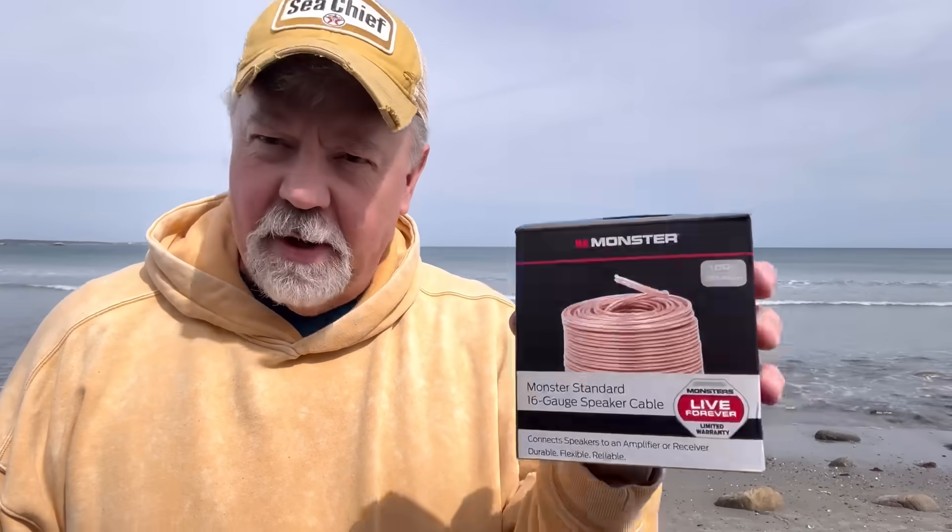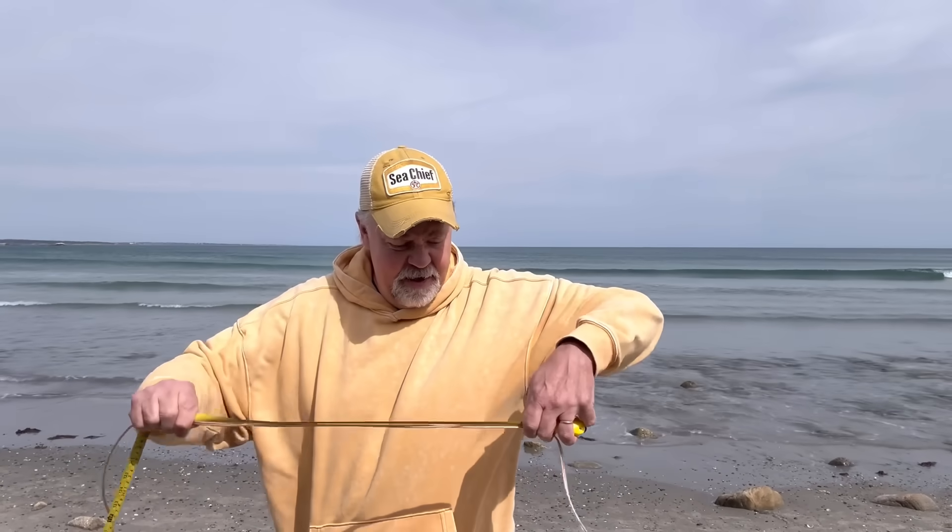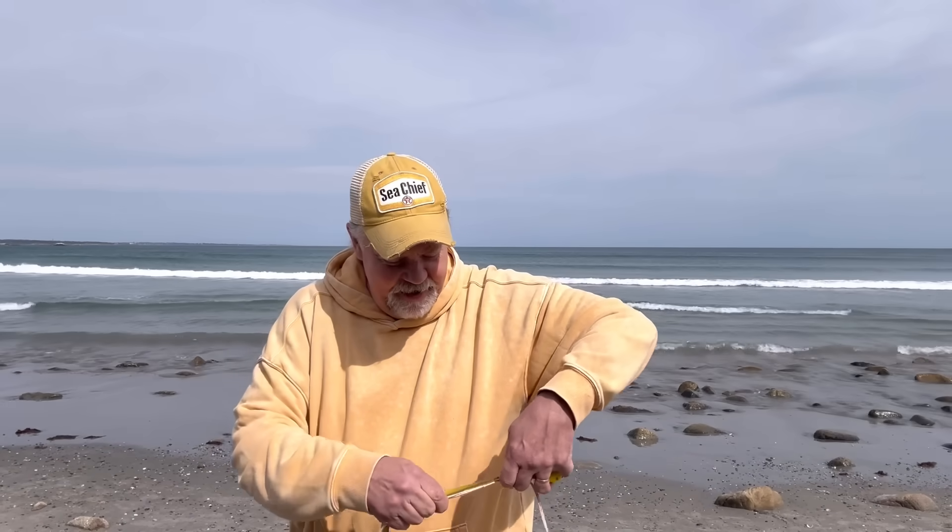Okay, to start with the driven element, I'm going to do the driven element which is 25 feet, 7.6 meters. This is monster speaker wire. I get it real cheap here in the United States at Walmart. Copper wire comes 100 feet at a time, so it's double — you're getting 200 feet of wire. What I do to start off with the driven element is measure it to 25 feet. So I've got my tape. I like to get one of these cheap tape measures that has both imperial and metric. I start with about an inch extra.